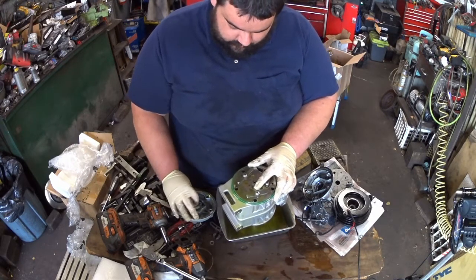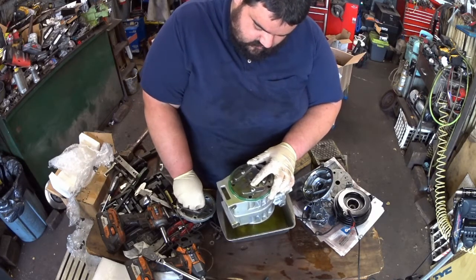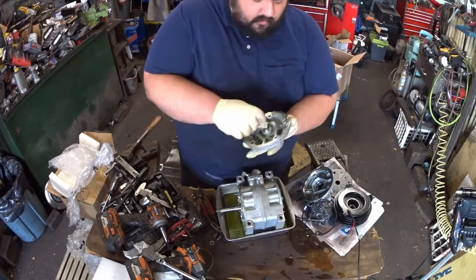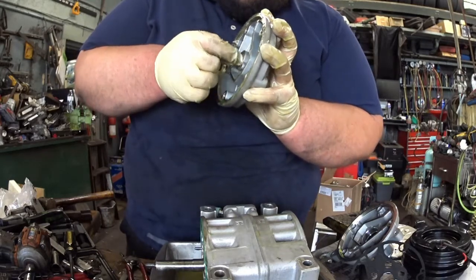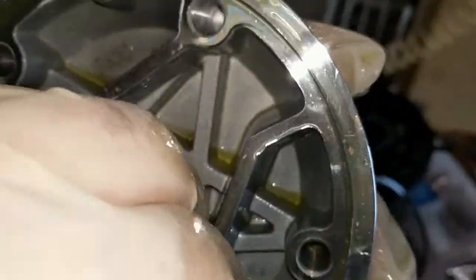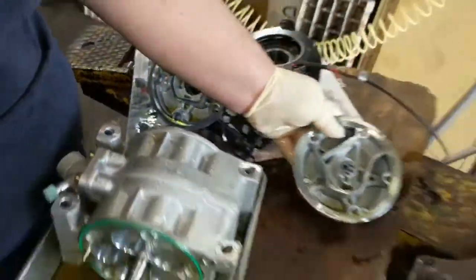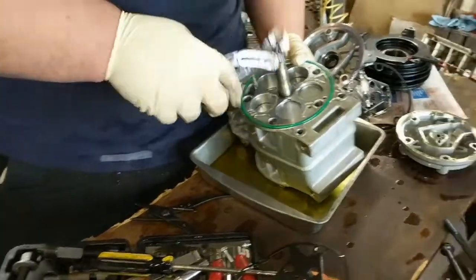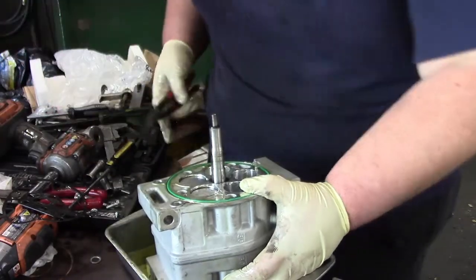I'm going to take the oil pump out and look for wear. You can see — it won't pick up well on camera — but there is some wear inside that oil pump bore. The oil pump should rotate freely and smoothly, and I can feel it is not particularly free. Now let's see with this separated if we can turn the shaft. Nope — so we have something else failed in this compressor.